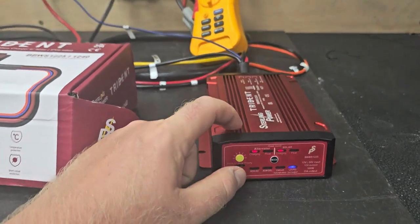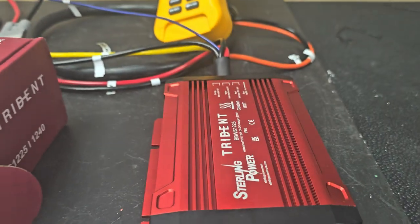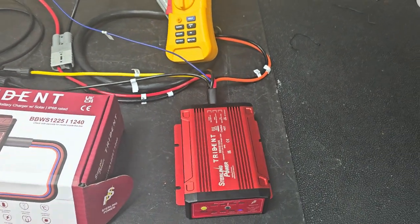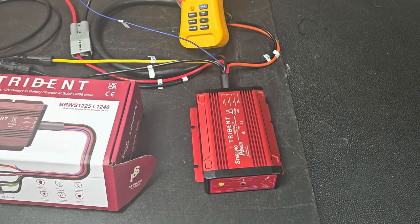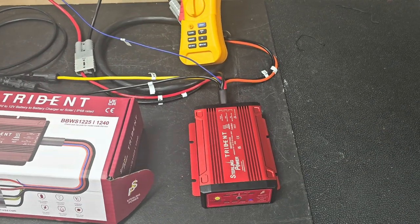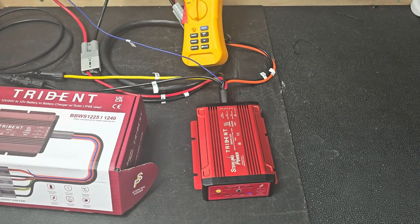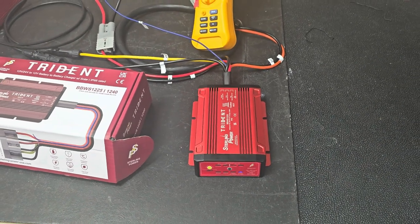Because this is a hybrid unit where it's got solar and DC to DC, 12 volt to 12 volt capabilities and it's 25 amp rated — the little one — we do a larger 40 amp one. You are going to get a total of 25 amps on the output. It's not solar plus DC-DC charger at the same time, so it is a compromise if you have lots of solar you want to use all of the time and want to charge up really quickly using DC-DC. I'd still recommend going for two separate devices — an independent 40 or 70 amp DC-DC charger and a separate 30, 40, or 50 amp MPPT solar regulator — because you get the benefit of redundancy and combined power.